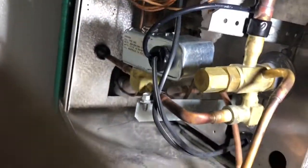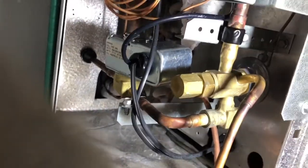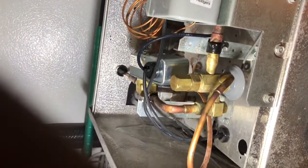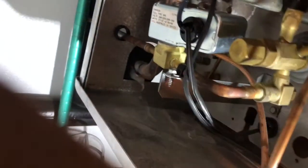I've got to change out this solenoid valve — it's chattering. When this unit shuts off on temp, when it starts to pump down and when it comes back on, it buzzes and chatters. So inside the body here, it's going bad. I've got the plunger in there. We're going to get this out. Very tight quarters in here. I've got to get the torch in here and everything and be careful.